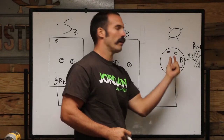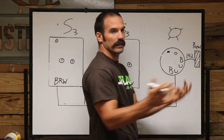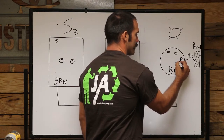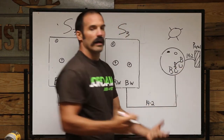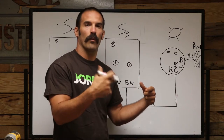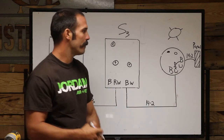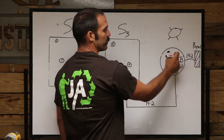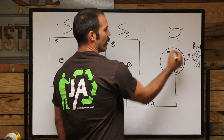This black wire is your hot wire. You cannot have two neutrals going to a light, so you have to re-identify this white wire — it is no longer a neutral wire. Tap those two together with a wire nut, and put a little electrical tape on that white wire to let any electrician who comes behind you know that it is now a hot wire.